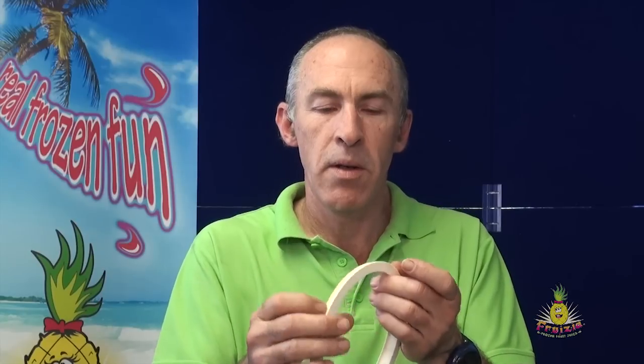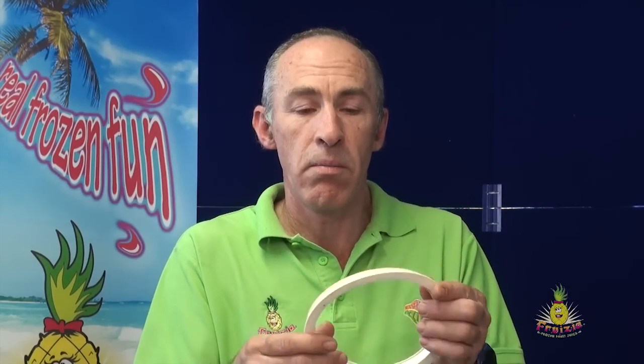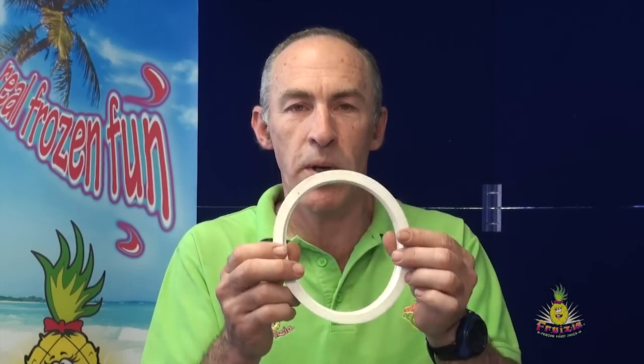You must also make sure that they're properly cleaned on both sides and the surface that it sits on. That's the biggest single cause of juice running down underneath the bowl and into the tray. It will drop the whole of the bowl into the tray and all over the floor, so it's really good to make sure you've got this correct.